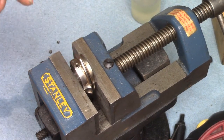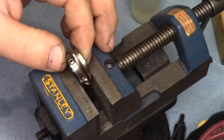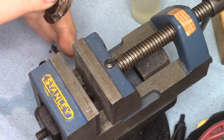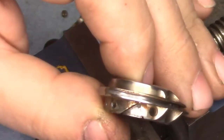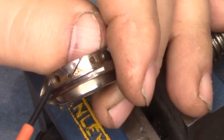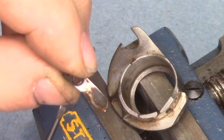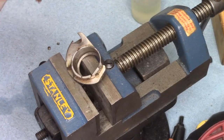I want you to see what you don't see when you just look at these things in place. Now here's the leaf spring — I'm going to try to get it out with tweezers to keep my fat paws out of the way. There's the leaf spring. And here's what was underneath it — see all that rust and crud in there. That would have been completely missed had I not taken it apart. The back of the spring is just as bad, filled with rust and crud. I'm hoping I can clean this well enough that the spring will be reusable.